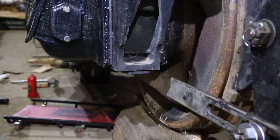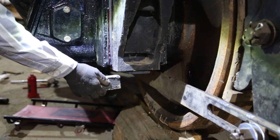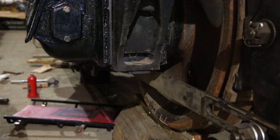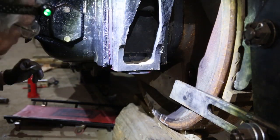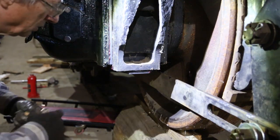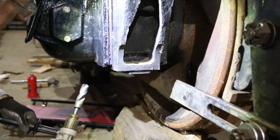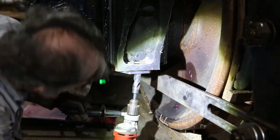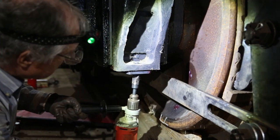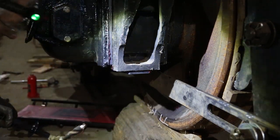The next step is to install the pedestal tie bars. These connect the two jaws together and keep the boxes from coming out if something unnatural should happen. Unfortunately, what happens with these things over time is these holes get crud in them so that you can't get the bolt in. So we get our wrist breaker drill here and cross our fingers that we don't do just that. Like that. Almost got me, but not quite. Do the good old machinist wallow out.